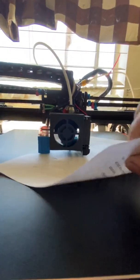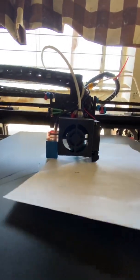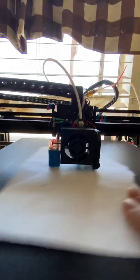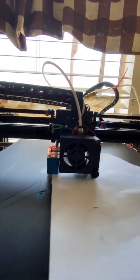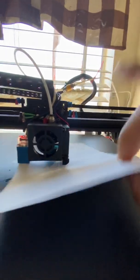See, the paper goes drag — that's one too many. Then down one. Now the paper moves freely but it's still just grabbing. You can move it, put it in, pull it out, but you can't pull it out easily. So the offset is set there.